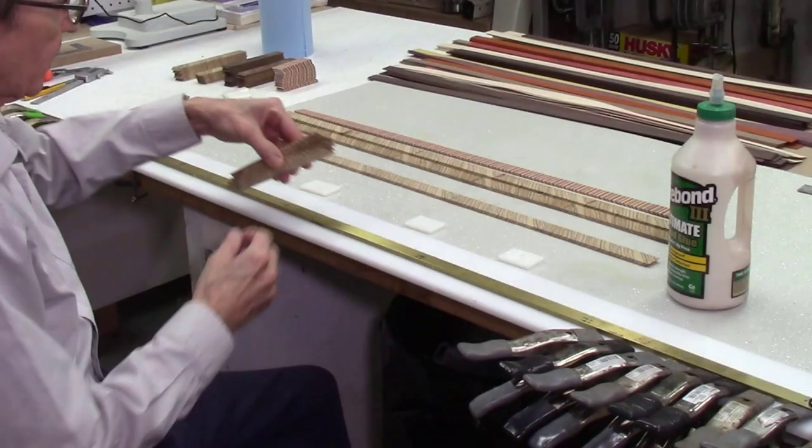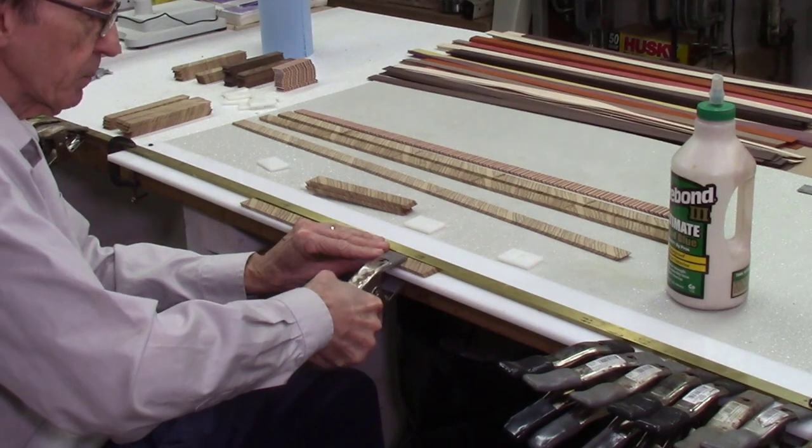Next I need to glue my pieces together to make one long strip. These are the pieces I cut on the bandsaw and they already have a 45-degree angle on both ends, which is a nice scarf joint — easy to glue and a fairly strong joint. My setup is a piece of high-density polyethylene plastic about a quarter inch thick and four inches wide screwed to the bench with an overhang, with a piece of brass as a straight edge so I can line up and glue the pieces. I just finished gluing one up — it glued up pretty nicely. I have this overhang on the table so I can use my clamps to clamp it in place.